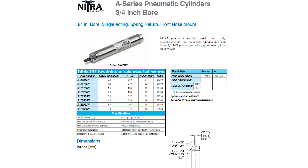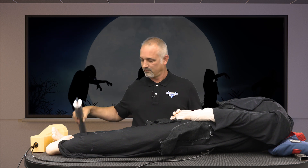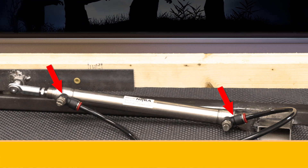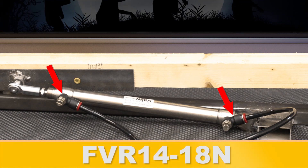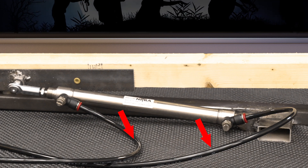This cylinder can lift 40 pounds with 100 psi. If I need to move a larger prop or item, I would have grabbed a larger air cylinder like this one. I installed a few of our flow control fittings, part numbers FVR14-18N, to the cylinder and a few feet of our black ¼ inch tubing.